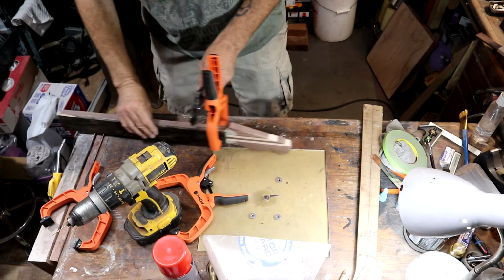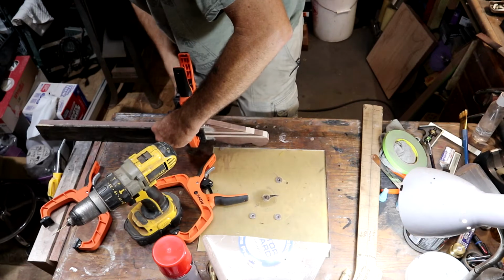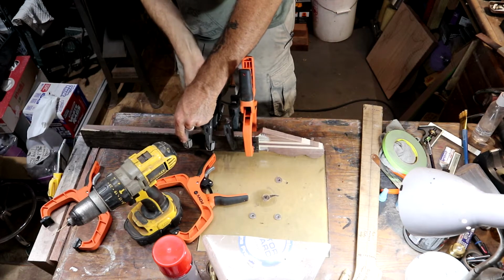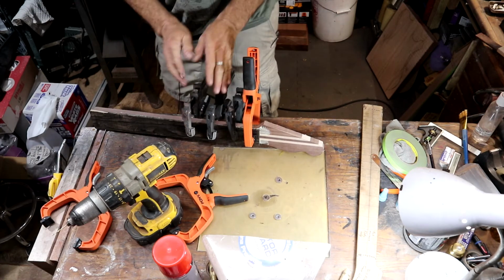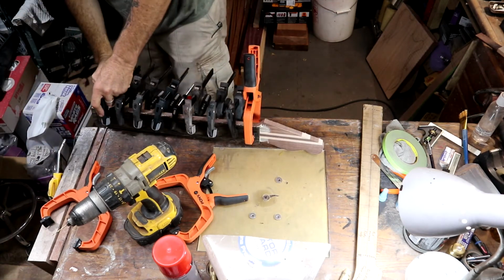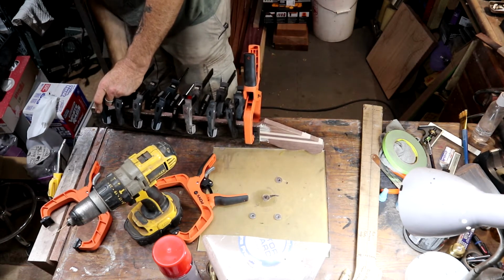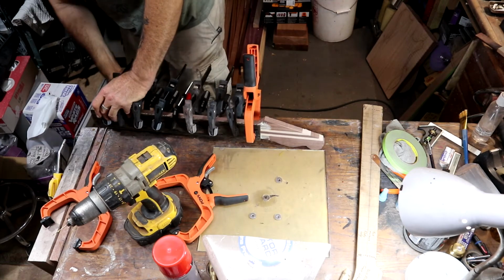I've got so much sanding left to do, I'm going to clamp straight to the fretboard. And you don't need much pressure anyway. I just want enough to get a nice even squeeze. And remember guys, I like to work my way down the length of the fretboard, from one end to the other, if that makes any sense. As long as this neck's flat, like it is right now, we can do anything we want to it. I mean, if I want to put binding on this fretboard, I can still do that. It's not a problem.